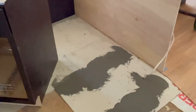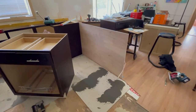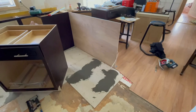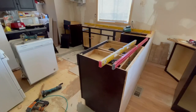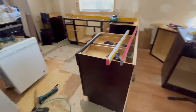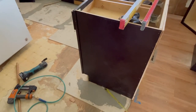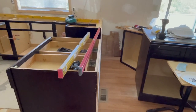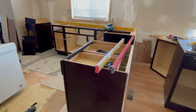Just showing you that I filled in a little more HardieBacker underneath for this last cabinet. The dishwasher will go there. That end panel and that peninsula panel will fasten to this end cabinet — I'm waiting for that to dry. I'll bore a hole for the receptacle. Here's what the kitchen is shaping up to look like. Put a leveling block underneath here — you can see down the line, it's pretty darn straight. You have to watch the 4K camera because it tends to curve things.